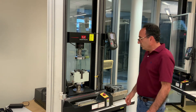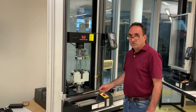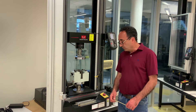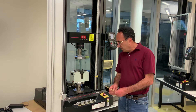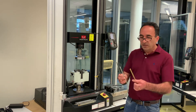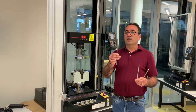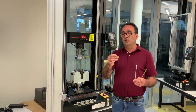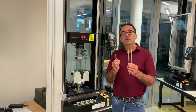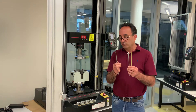So what is the shear test? Basically, our objective is to get the maximum load that will cause our specimen to shear off. Normally we're going to use four samples, but I have three here: brass, aluminum, and 1018 steel - the same one used in the tensile test. These are exactly the same materials used for the tensile test for the standard threaded samples.